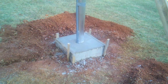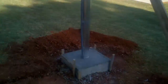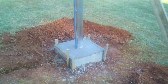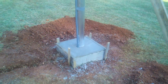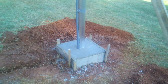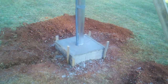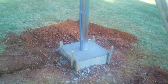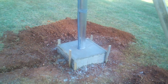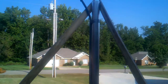The pipe itself is about 11 feet, with an outer diameter of four inches. It's a schedule 40 aluminum structural pipe and it's 51 inches deep. The hole diameter was 18 inches, with six inches of crushed rock at the bottom and the pipe sitting on top of that. And again, this is flexible conduit on the side.